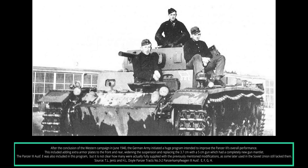During the early stages of the Panzer III's development, the Germans were aware that there was a possibility of the 3.7cm gun becoming obsolete. Lack of production capabilities was the main reason for not installing a more potent gun from the start. This is the reason why the turret ring was left wide enough for a larger caliber gun to be installed. In December of 1940, the rearmament of the Panzer III Ausf E with the 5cm KwK L/42 semi-automatic gun began. With the new gun also came a new, rounded, 35mm thick external gun mount. Another change was the reduction of the number of machine guns in the turret to one. The ammunition load was reduced from the original 120 to 87 rounds — or, depending on the source, 99. The removal of one turret machine gun also led to a reduction of machine gun rounds carried inside the vehicle to 3,750 rounds.